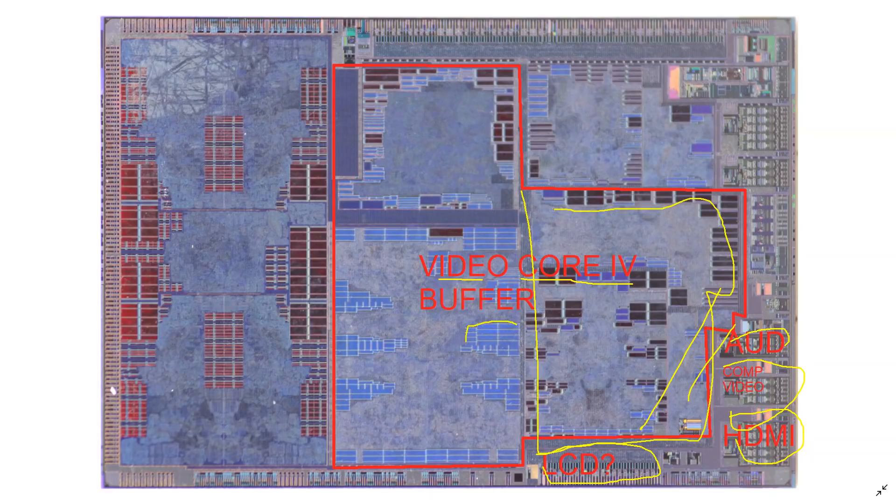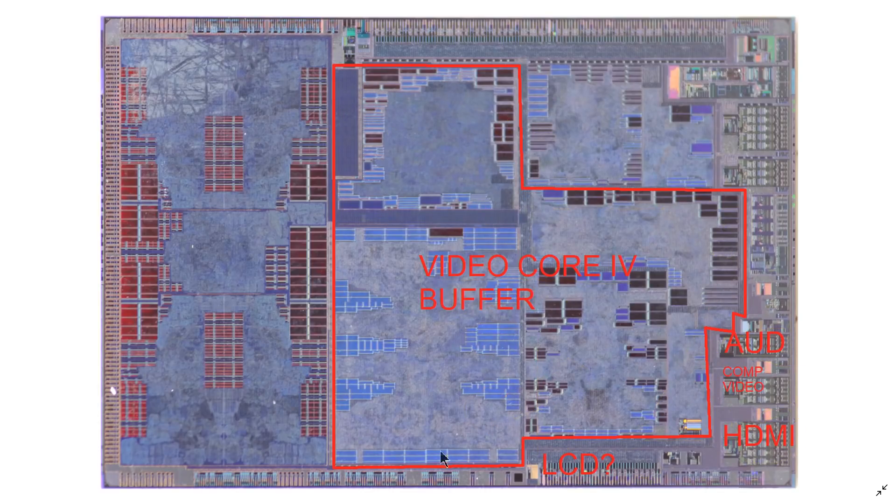You can see a lot of little lighter blue areas - again, SRAMs or just logic. That's actually a lot of SRAM, and it's quite likely this is probably the buffer function, because the VideoCore 4 has video buffer capabilities. Broadcom is a super secretive company, so there's no real data sheet. There could be all sorts of latent features on this chip that haven't been described to the public. I believe the VideoCore 4 is right in the middle, occupying the greatest amount of silicon. If you've ever unsuccessfully booted a Raspberry Pi, you get four colorful rectangles - that's the VideoCore 4 booting up, and it boots well before the actual ARM core. So in this chip, quite unusually, the VideoCore actually controls the boot cycle.